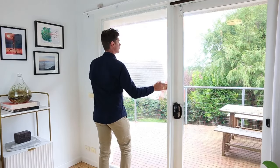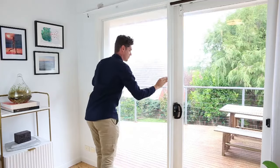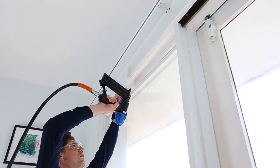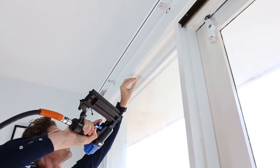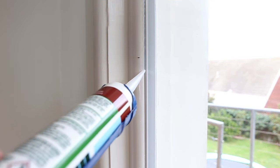Install the secondary glazing, seal the perimeter, and once the silicone has cured, fasten your choice of timber quad to suit your desired finish. I've used a brad nailer with 25 millimetre nails for this exercise — feel free to use a hammer with nails. Finally, seal the quad with another bead of silicone.